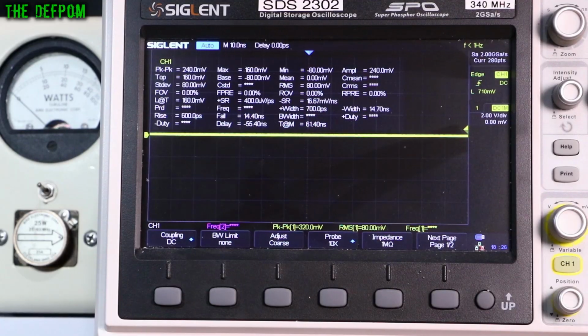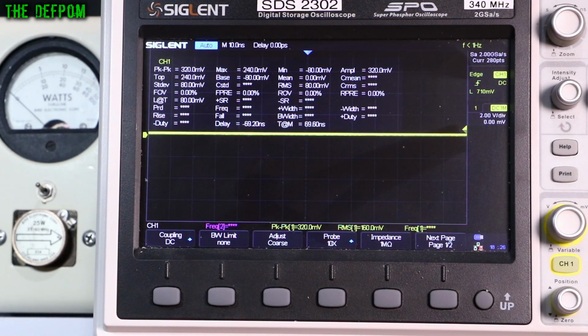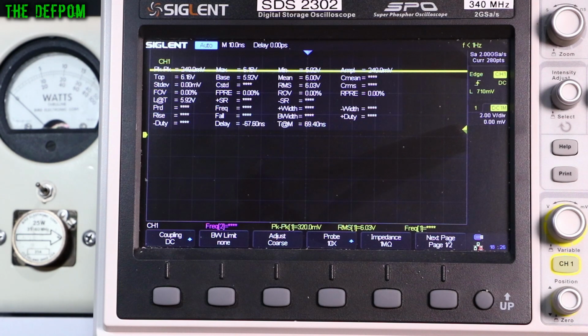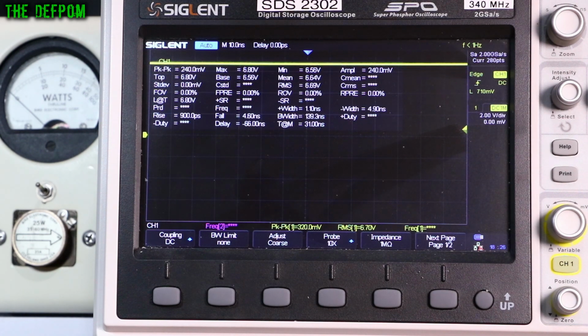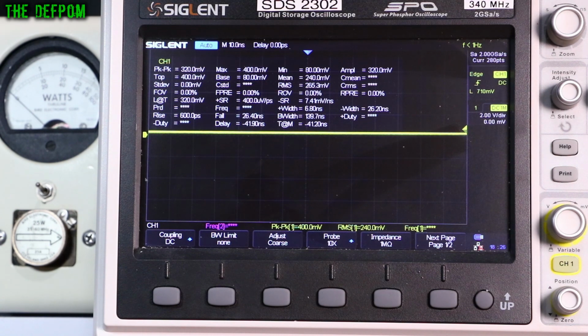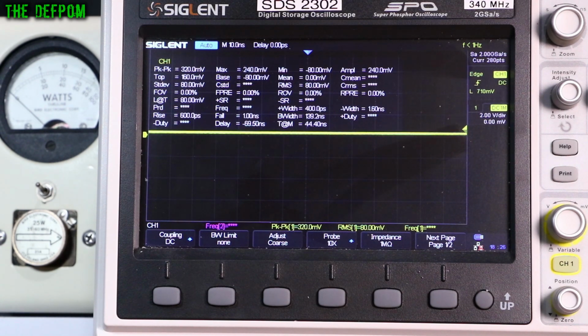Let's do that. So I'll show you what I was seeing at that particular resistor, the same spot I was showing you just then as I was doing those changes. So that is FM, AM, upper sideband, lower sideband, and CW. There is a slight step up there because it uses diode steering for these voltages, so there will be some slight changes in some places. Okay, but AM is low, that's the critical thing there. It does have a very slight voltage there, but it's almost nothing.